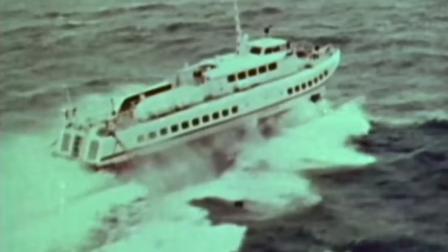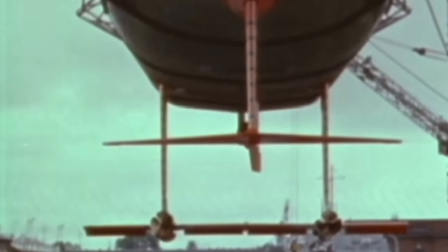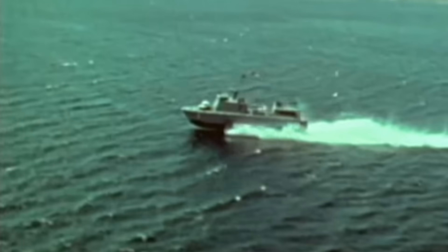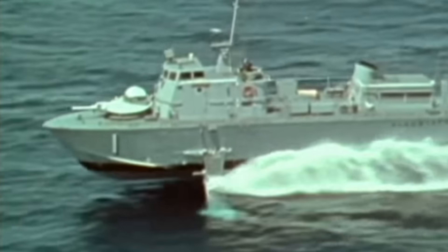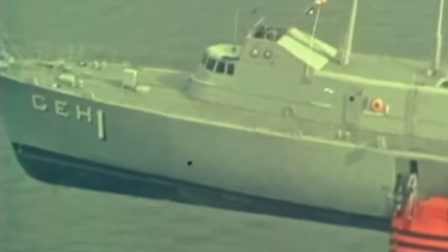Anyways, let's get back on track. The passively stabilized hydrofoil is not what I want to make. Passive hydrofoils are at the mercy of rough water, since the wave height will change the amount of lift the foil makes, which then makes the boat go up and down with the waves. I want to make a fully submerged foil that is shaped like an upside down T. The benefit is that they are immune to choppy water because the wing itself is always underwater, generating a consistent amount of lift regardless of wave height as long as the waves are shorter than the height of the vertical portion.